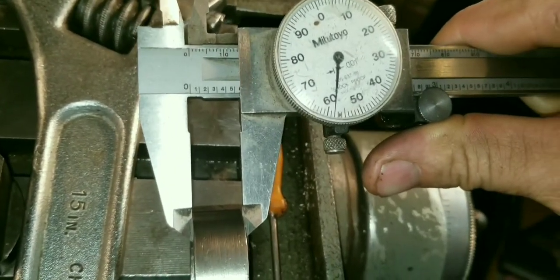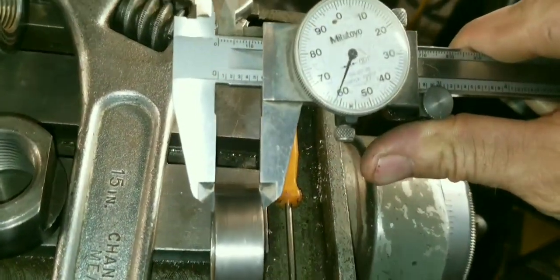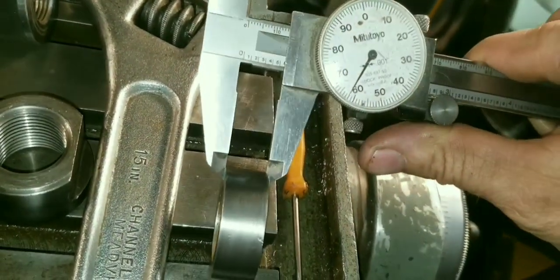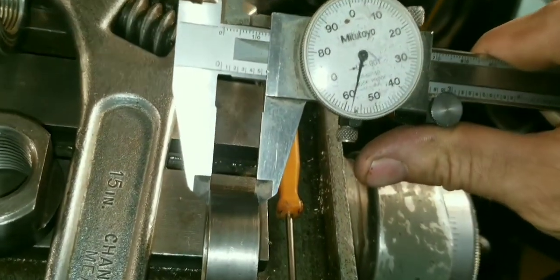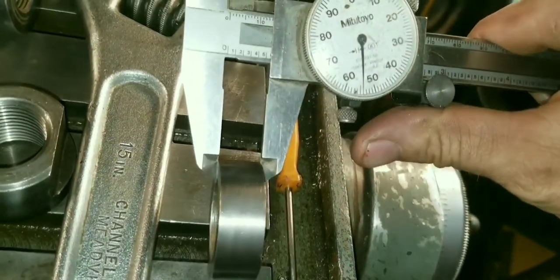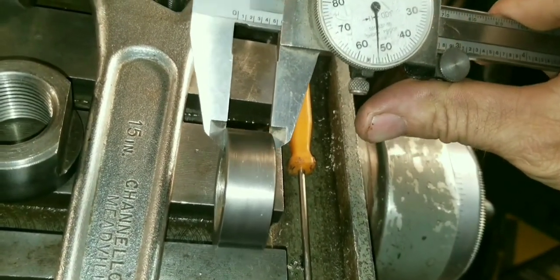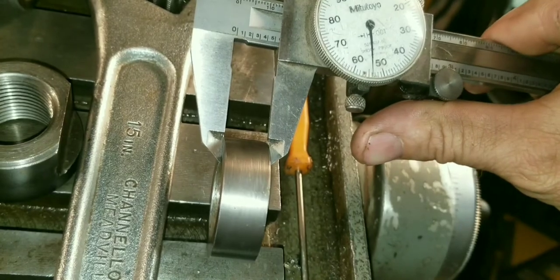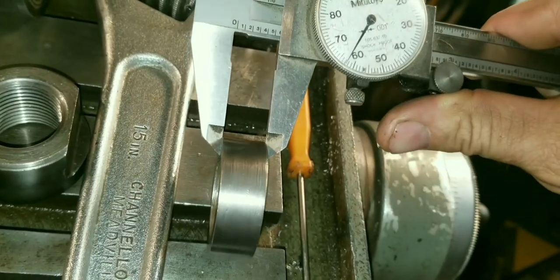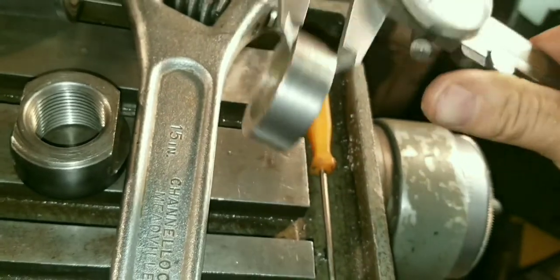So there's 58. Going down here, 62 going around. 62 again going around. Now we're dropping — 58 again going around. 56, 57, 54. Still 54, 54. So 54 is the low spot and 62 or 63 is the high spot. 56, 54 — so that thing's junk.